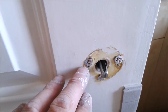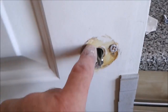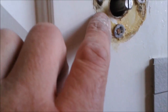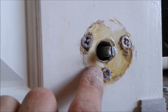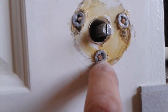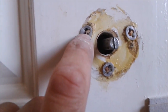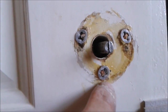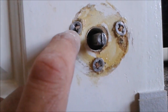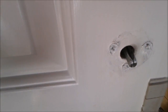This one was really bad — and these are MDF doors. It's been tried previously, you know, tried to glue it. The holes got so big. So what I've done is trim some plastic roll plugs down, put them in, and then just a little piece of wood inside each roll plug. When I put the screws back in this will be nice and tight — this one was the worst one.